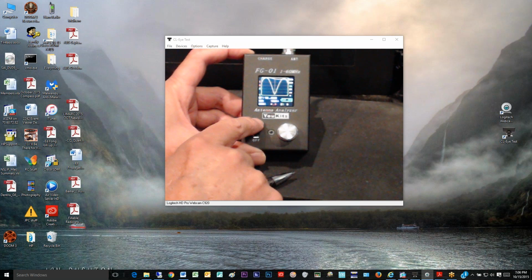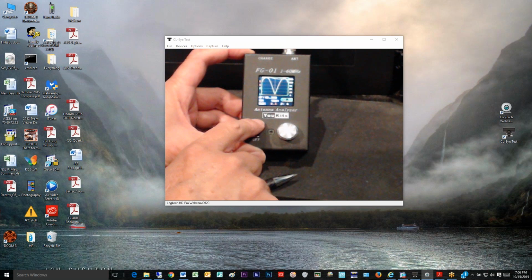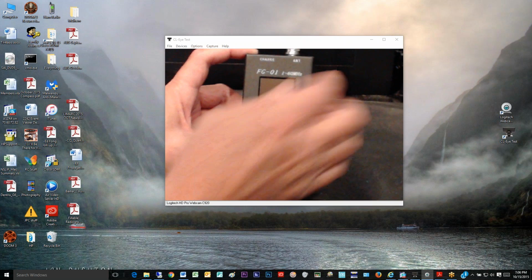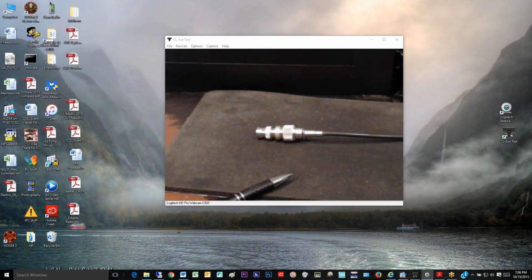Okay, that's what an antenna analyzer is. It's a kind of useful tool. I don't use it as much as I thought I was going to use it because I have an antenna tuner, so I don't even bother with this so much. I just roughly measure out the antenna using my formula, whatever the meter I want to approach is, times 3.28, and I usually work with dipoles, and I'll just hang the antenna outside, and then my tuner takes care of the rest, generally. Okay? Depends on what I want to do and how precise I want to get. So that's an antenna tuner. And then lastly, hold on, let me put this away before I break it.